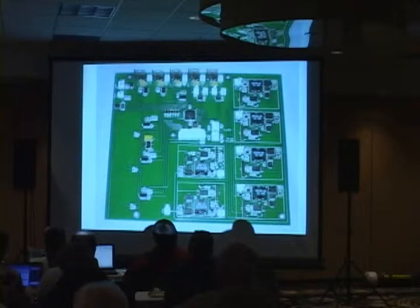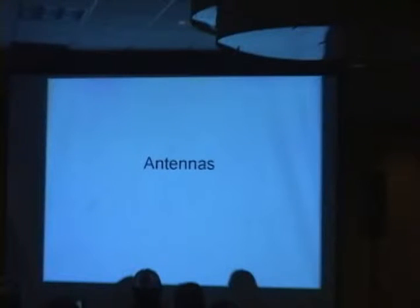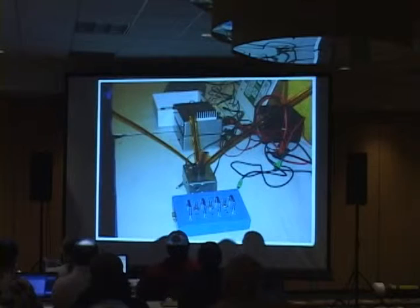Each of these max solar power converters is autonomous, independent autonomous. But what we want to do is collect data from them, and then that data will be sent down in the telemetry stream. And we would be able to see things like, okay, how's this one particular panel doing? What kind of current is going through it? And then these are switches that switch power to the experiments, to the cameras, antennas.